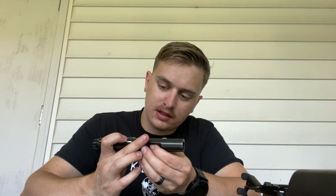Then you're gonna take your firing pin, slide that right in the back there, push it all the way, seat it all the way. Then you're gonna take your firing pin retaining pin, put that thing in there. Now once it's together, you wanna make sure you test it. So flick, click, flick, click. And if that works, your bolt carrier's put together the correct way.